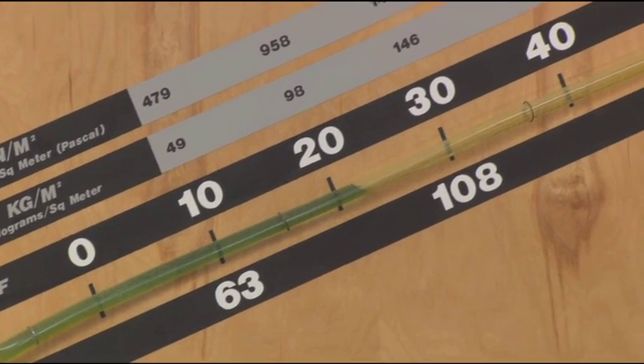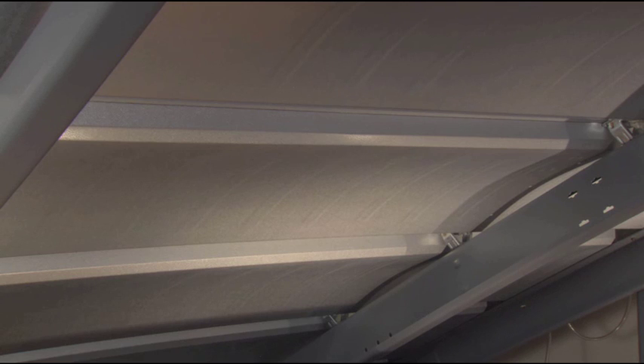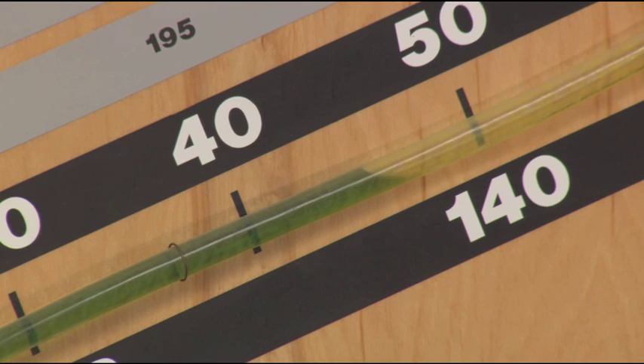At class 30, you begin to see the deformation of the panel. The uplift pressure is about 45 pounds per square foot — that's the same pressure achieved in a 120 mile an hour wind. You might ask why you'd bother going all the way to a class 90. What happens is that 45 pounds per square foot is the pressure of just the horizontal wind blowing into the side of the building, but it's got to go someplace, so it rushes up the building. There's more wind at the top, and it creates almost like a mini tornado — high forces around the perimeter of the building. So this 45 pounds per square foot of pressure can be achieved at a lower wind speed simply due to the aerodynamics of the wind blowing across the building.